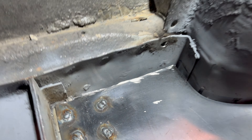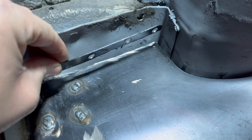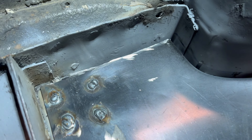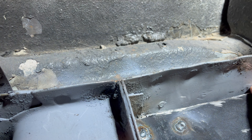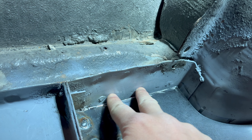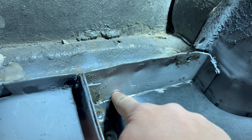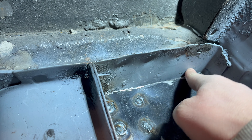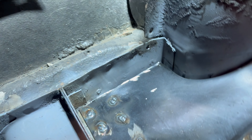I amended my earlier plan. I went ahead and cut off the tab - the tab that was vertical that was never going to reach. So I cut that off and now I have nice access to everything. Before I weld, I'm going to get back here and clean up. I did do that before in anticipation of welding it in. This is weld-through primer, but I'll probably - it looks like I missed a spot. I'm just going to wire wheel this to make sure I don't have anything crazy back there and reapply weld-through primer.